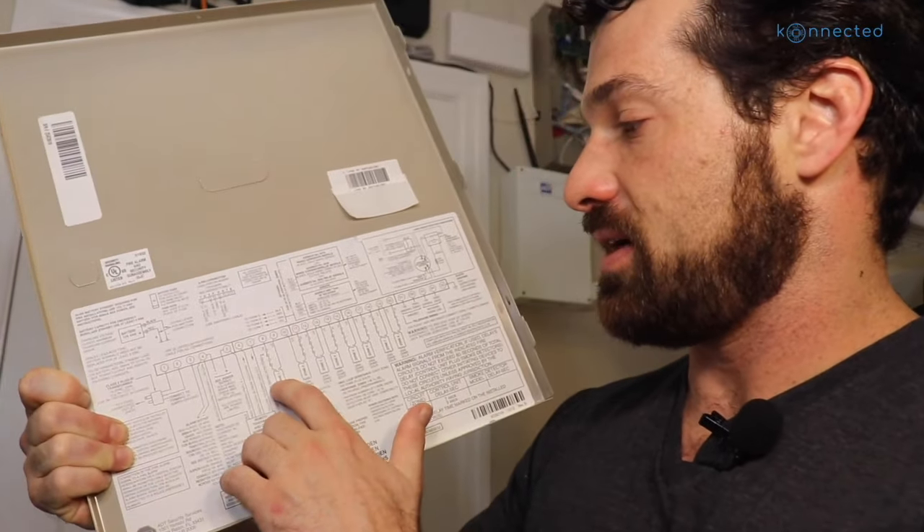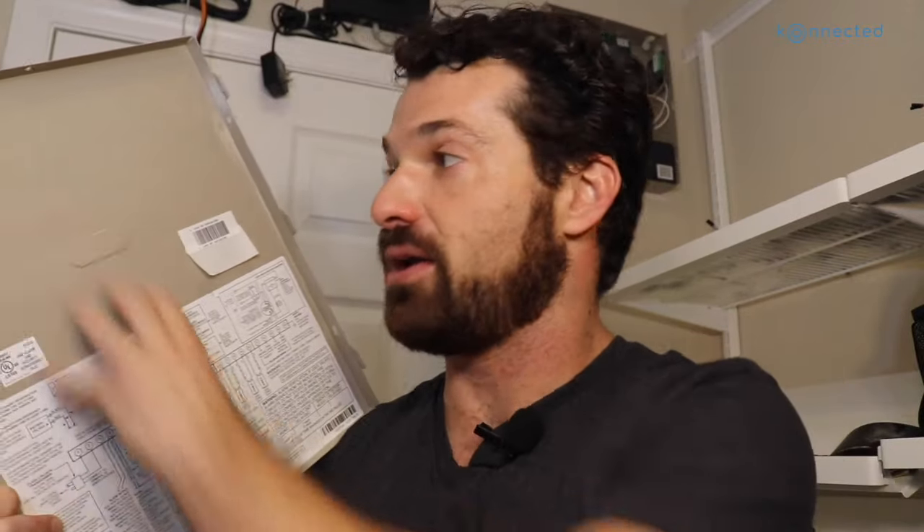Labeling is going to make it really easy to program the zones later once we have it connected to the Alarm Panel Pro. A good clue is to look at your zone numbers, and sometimes you might have a zone listing on the keypad by your entry doors, or perhaps inside the panel there will be a handwritten zone listing saying, for example, zone 1 front door, zone 3 motion sensor, something like that. If you have that, great. If you don't, we'll figure it out as we go.